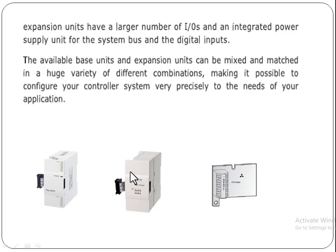These modular expansion units are added according to your requirement — how many inputs and outputs your system requires. A large number of IOs will need an integrated power supply, but if you do not need too many IOs, then the available power supply from the PLC can also be used to run the digital IOs.